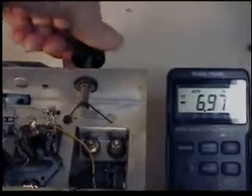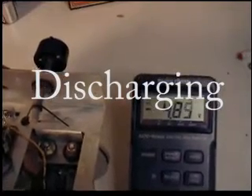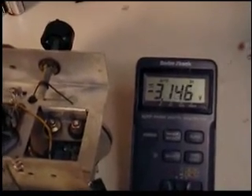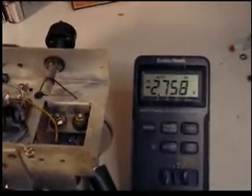I've got the 33 microfarad capacitor in parallel across that .05 capacitor, and I'm going to tune it to that weak station. Notice how quiet it is — I'm going to turn up the volume all the way. That capacitor is slowly charging through those resistors. And as it discharges, the volume of that weak station is coming through. It will continue to get louder until it finally gets down to that 1.6 volts, and then it'll stop. I think you got the idea.